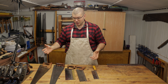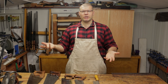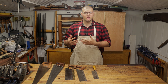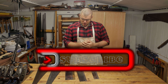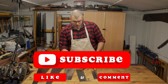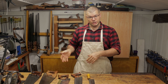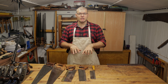If you're doing a lot of rough dimensioning then the hand saws are probably the way to go. However, if we're looking at a first hand saw for a beginner, we probably don't need to go to those saws because you're most likely already working with dimensioned or planed timber that's already ready to go. So perhaps a tenon saw is the way to go if you're doing lots of tenons, or if you're doing lots of box work and dovetails, perhaps a dovetail saw or gent saw is the way to go. It obviously all comes down to what projects you're doing, so let's dive in and go a little more in depth to help you make your decision.